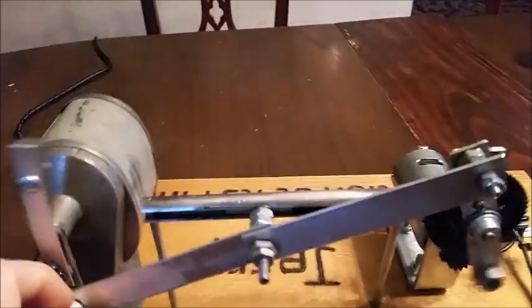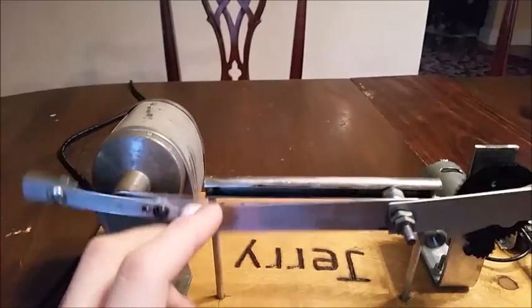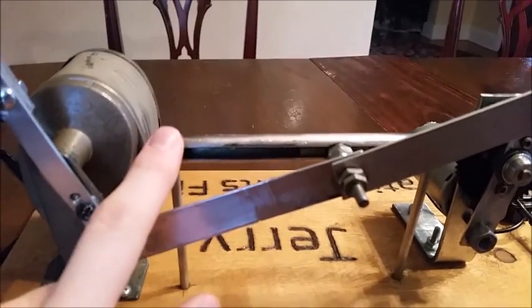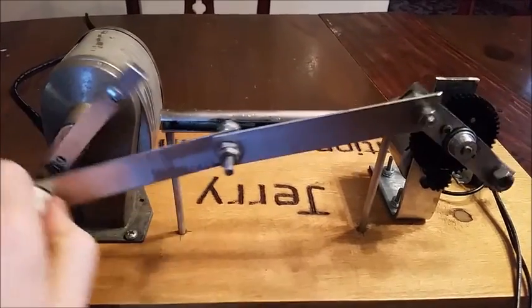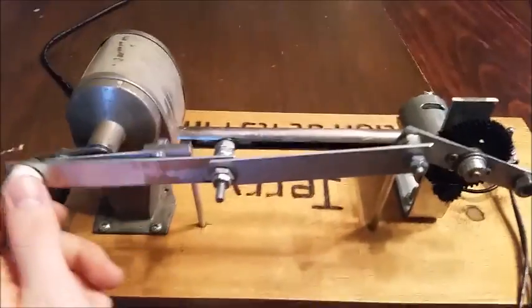So in order to get this linear sliding rail thing, we took a pipe, I think it's steel, and I hacksawed a slot into it, which took forever. But that was just two hacksaws all the way along the length of the pipe. And then this piece that's in there, we took a rod that fit well inside of this pipe, and I drilled a hole in it for this peg, and then I glued it all together so that this rod slides well in the pipe, and I greased that up. Then these are just aluminum bars, and most of it is put together with nuts.